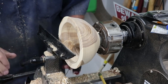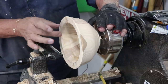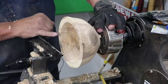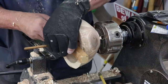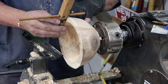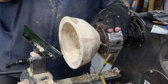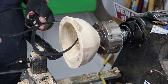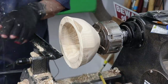I am very close to having this little bowl rough turned. It's just right at eight inches, maybe a little bit less. The wall thickness should be 10 percent of the diameter — this may be closer to an inch; I may take that down a little bit. I'm measuring with a couple different devices — this one measures the thickness at the bottom. I've got to take into account the thickness of the spigot or tenon, which adds a little bit of thickness. I'll use my Andre Martel calipers to make sure my wall thickness is even all the way through. That looks pretty good on the base.